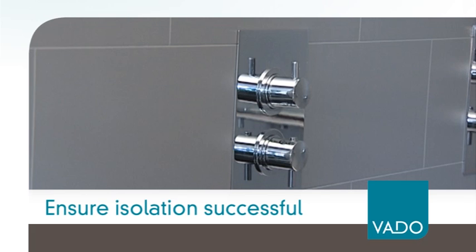You may now carry out the required maintenance to your valve. If water continues to flow at any stage of the isolation process, it will be necessary to isolate at an alternative point in the system for both hot and cold water supplies and repeat the isolation process.